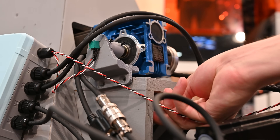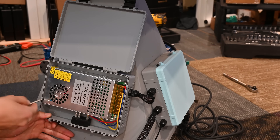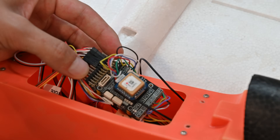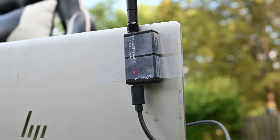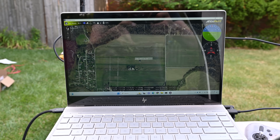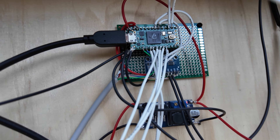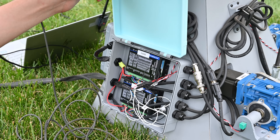After the paint was dry I could do the final installation of electronics. A lot of the work for this project was actually just the electronics and the software — and honestly it's a bit of a chaotic mess. The plane runs an ArduPilot flight controller which transmits telemetry data with a 900 MHz radio. Those data packets are received by the same radio on the ground and shown using QGroundControl on a laptop. The telemetry packets are also forwarded to an internal UDP port where a Python script reads them and turns them into position commands for the chair. Those position commands are then sent over serial to a microcontroller, which converts the position demands into step and direction signals for the actuators.